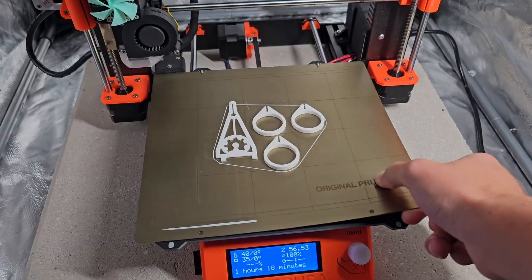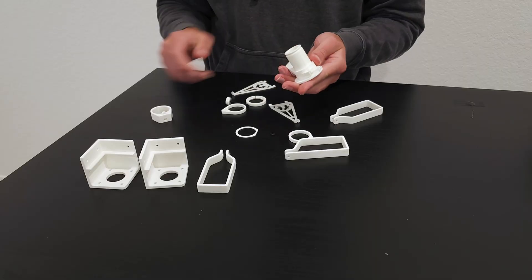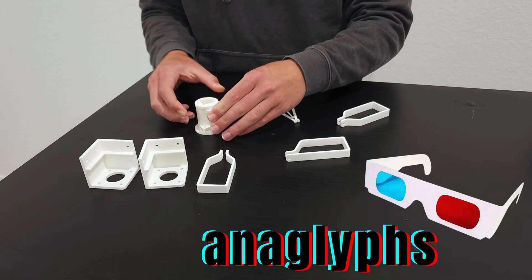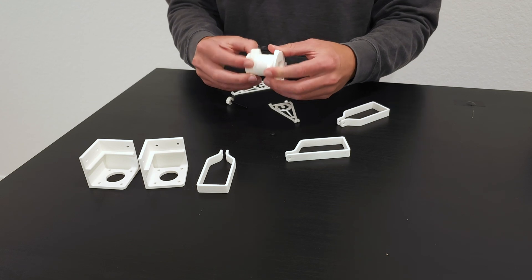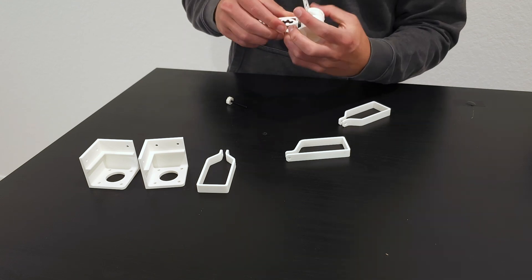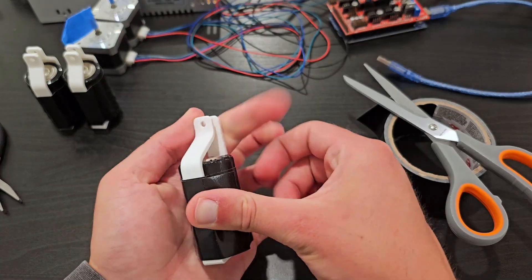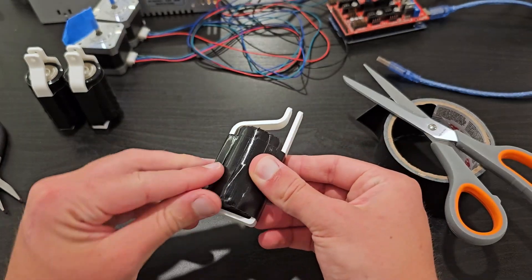When I woke up I found some pristine models coming off my Mark 3 that were made by Degizmo on Thingiverse, which I've linked down below. If I need any changes in the future I can always make my own — do some sort of tool changing gondola or have it mount tube pens and do anaglyphs or something. I snapped everything together for the gondola, and on the weights I just used some D batteries wrapped in black duct tape. I later added some more weights because I found a little bit of skipping at high speeds, but it works either way.